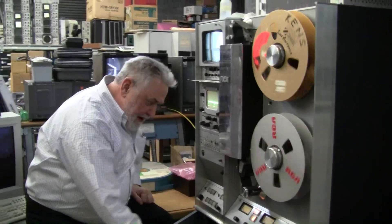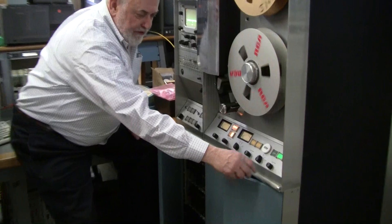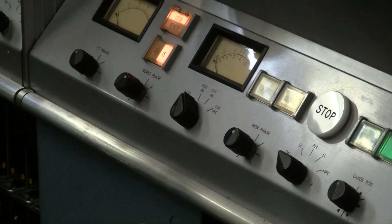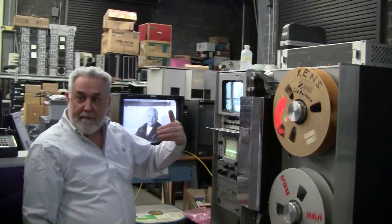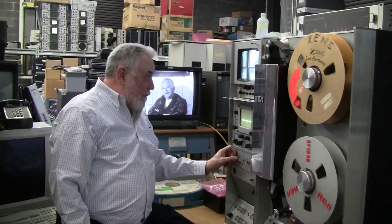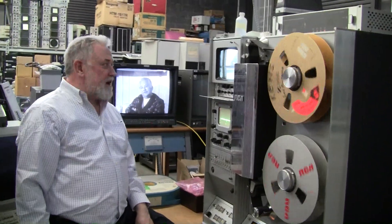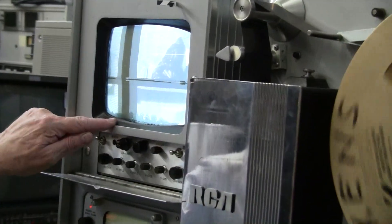The other neat thing is that the servos had all these different modes of operation. So if you had trouble with a tape, you could throw the thing into what's called tone wheel. Tone wheels are very loose — as you can see, it's a loose lock. It just does a rough lock of the head drum and the servo to the incoming sync, and you'll get a display like that. So the output of the machine isn't stabilized at all — but that's the amount of jitter. You know how much jitter comes up on helical scan machines? If you look on an externally locked monitor, that's what comes up on quad. That's how good quad is — pretty darn good, yeah — out of the gate raw.